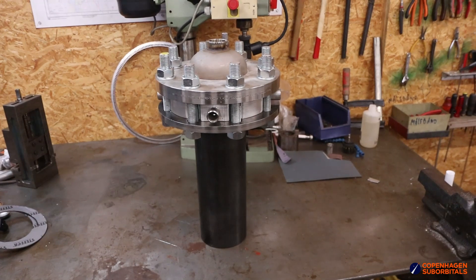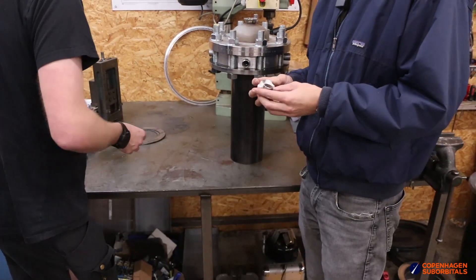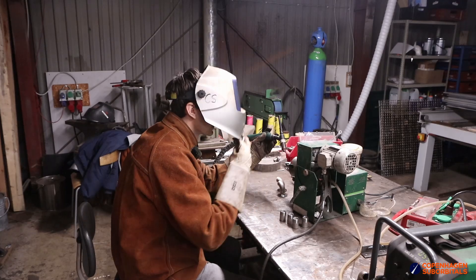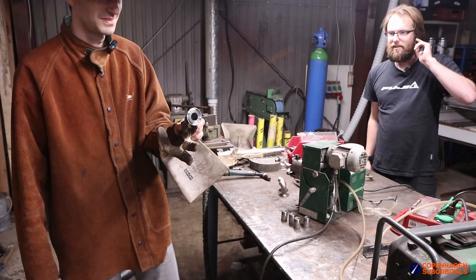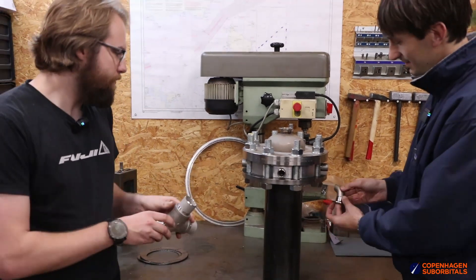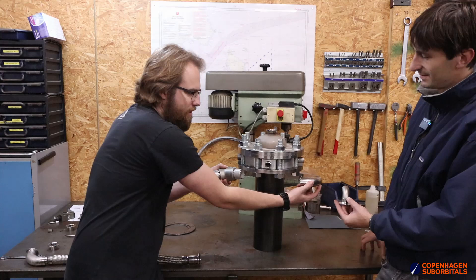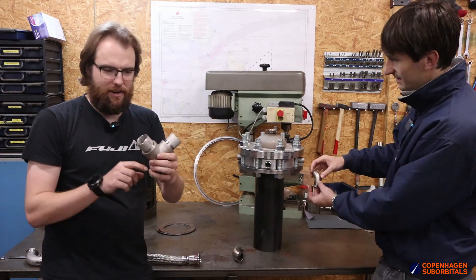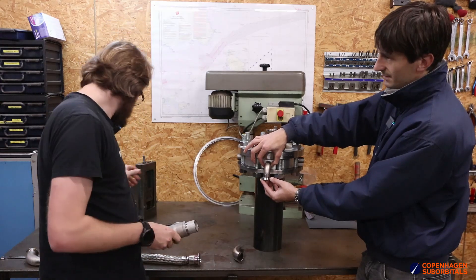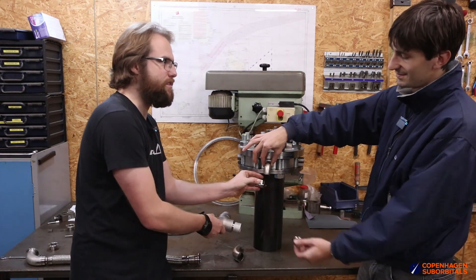Felix, at the moment you've been working on these — which are part of the outer fuel gallery for this engine. I've set you to try and weld some of it up. These four pieces are going to sit like that — one there, one there, and one there — and we're going to have these Y-pieces. If you imagine this sitting like this with a pipe that goes out, then a bend, then goes back and grabs this, and the same thing on the other side — you basically have this sort of shape with four outlets. We're using these fabulous dairy flanges for everything, and making it like this means we can pop it off, basically disconnect it.